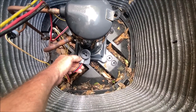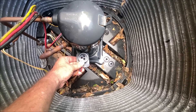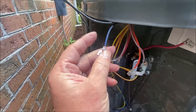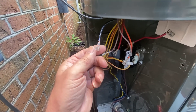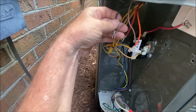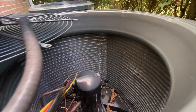When in reality, somewhere between right there where that black wire is, that terminal, and here where it goes to the top of the contactor — it's open. It's no good. I thought I had an open winding between the red and black here. I mean, it was open no matter what. I thought I had an open compressor.